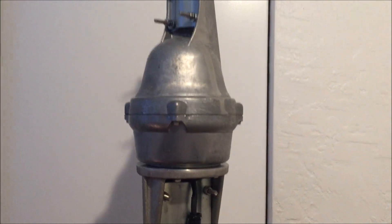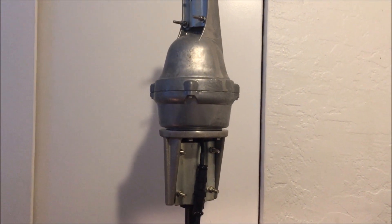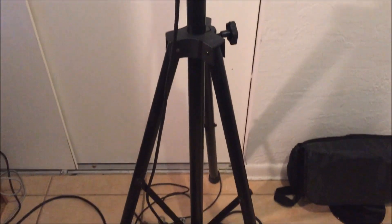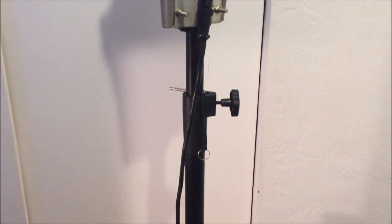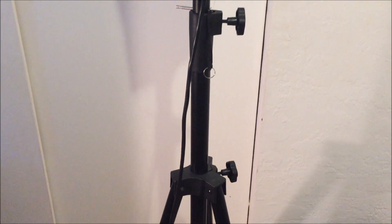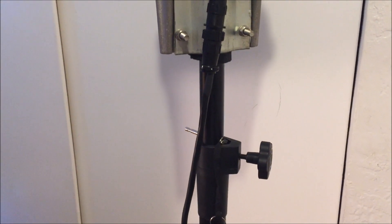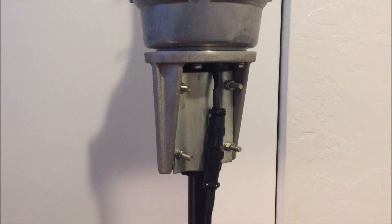Looking at the rotator itself — this is a HAM-5 rotor. The specifications online call it a HAM-7: the HAM-5 rotor with the DCU-3. Since it's way too hot outside in Florida right now, I haven't mounted this outside yet — but this is what I had at field day. I had this on the MFJ-1919 tripod, which handles 100 pounds, extends up to 7.8 feet, and opens to about 5 feet at the base — 690 square inches. I mounted it here using some rubber mat as a homebrew bushing because the tripod mast wasn't quite big enough to fit inside the rotor.